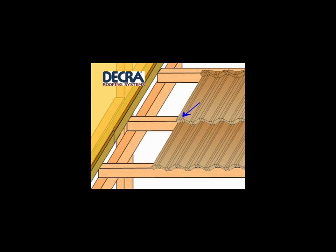For wall to roof junctions, flashings are installed before the wall veneer cover is placed. Measurements for part tiles are made from the centre of the last ridge valley to the wall framing. 40mm is added to the length for the turn-up required under the flashings. Part tiles are slipped under the flashings and interlocked with the pre-laid tiles on the roof.